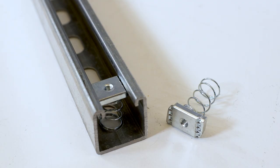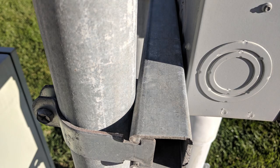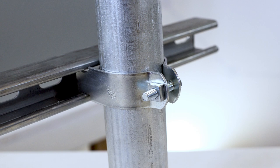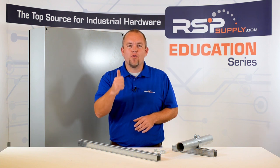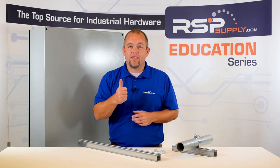When installing an electrical enclosure on a pole or mast, the installation is not too dissimilar from the wall mount, in that you will still rely on using the mounting strut that is on the enclosure. It is important to make sure that the pole being used to mount the enclosure can handle the weight being placed upon it. If you are installing the pole, make sure that the footing is below the frost line if being installed in areas where temperatures can get very cold.